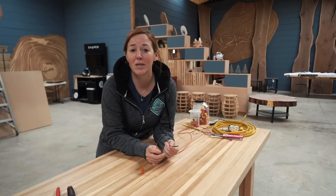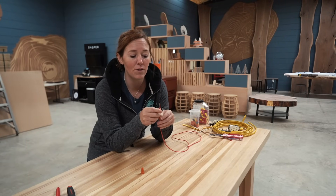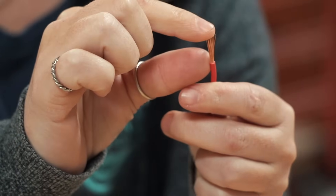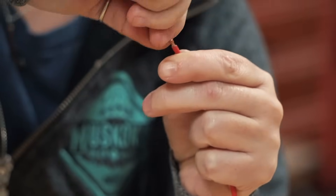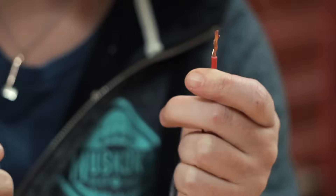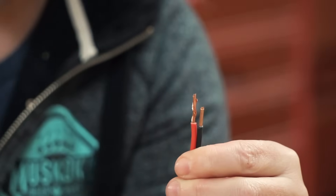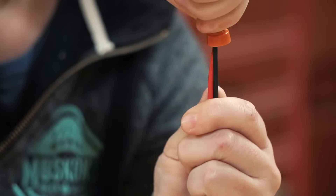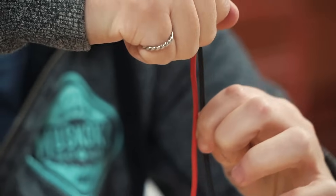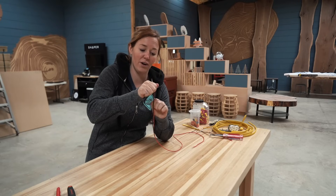If you're wiring something in your house such as replacing a light fixture, the wiring in the wall is likely solid, and the light fixture would have stranded wire. When making these connections, the stranded wire will often want to pull out. To prevent that, divide the strands in half and give them a good twist. Place it next to your solid wire but leave it about an eighth inch taller, so when you apply the wire nut, the stranded wire grabs inside first. Keep twisting until both wires twist at the insulation level, then give it a tug to confirm both are secured.